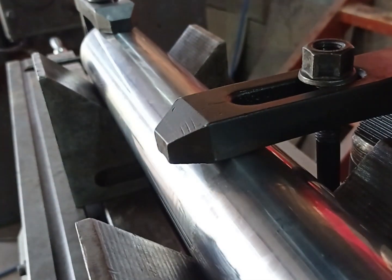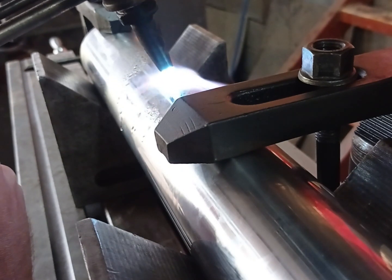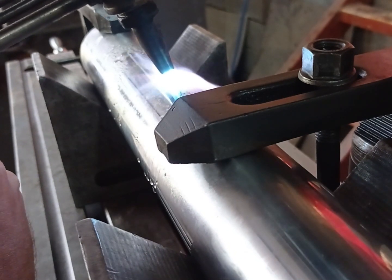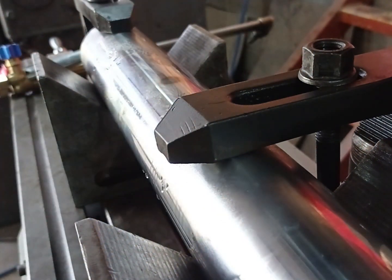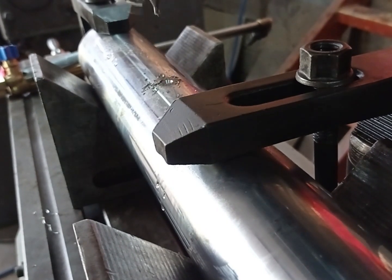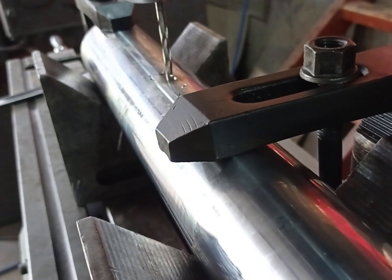All four of the pins are induction hardened chrome. I don't have any other drill bits other than twist drill bits, and getting through the hardened chrome is impossible without heating the pin to soften where I need to drill. If you have any other ways of drilling induction hardened chrome, please let me know in the comments. I have done it with carbide drill bits — they can drill through, but chip very easily when they exit the induction hardened chrome.